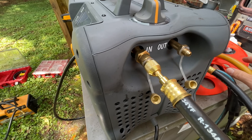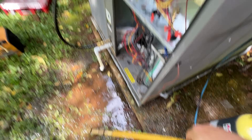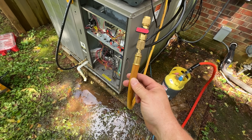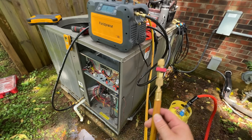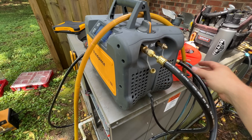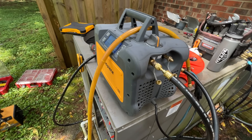That's really nice depending on the situation — if you don't want refrigerant spewing, whether you're inside or whatever the case. That's all you got. Of course you're going to have refrigerant in the hose, but there's nothing we can do about that. It's de minimis at this point, but at least you have control over where you vent it so it doesn't have to be where you're working. Sometimes I'm working in commercial situations inside a mechanical room and you don't want to be spewing refrigerant. Self-purge gets rid of anything inside the machine, then valve off the hose and you're good.